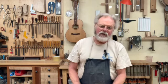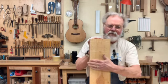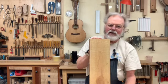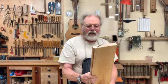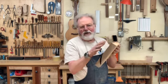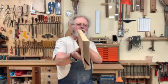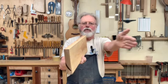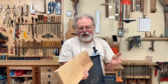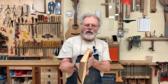The first thing you need to do when you dress lumber is flatten a surface. The reason I made a big deal out of that concavity and warpage is because you want the concave surface down on the table of your jointer — that's very important. Because if you put the convex side down, it's likely to rock back and forth unintentionally, and you may have a hard time getting that flat. By the same token, if this were bowed over its length, you'd want that concavity down as well. The concave surface has got to go down first if there is one.